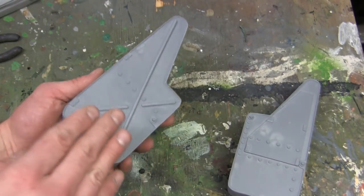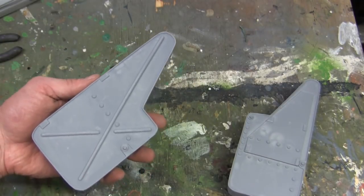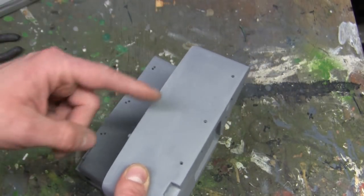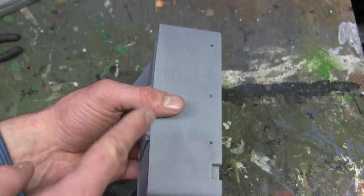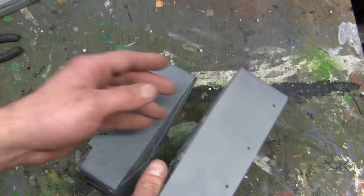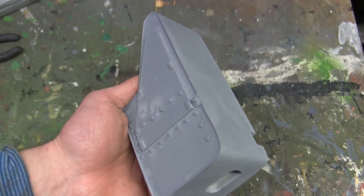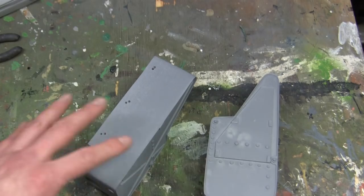The ECA sets are made from solid resin, so the removal of these sections is very easy compared to if the construction was made with a different format. The way these are going to be mounted onto the tank is with the same three fasteners located on the angle strip mentioned earlier — those three securing fasteners are for the cubby itself. Those three fasteners are going to serve double duty: they'll hold on the engine compartment to the tank and also hold on the fuel cells to the piece altogether. These three sections are tapped, identical to the opposite side. In addition to the fasteners, silicone will also be used to help adhere the fuel tanks to the side of the hull. The reason for the silicone is as a temporary measure; however, these pieces should never need to be removed from the vehicle. With them now fully painted, it is now time for the installation.